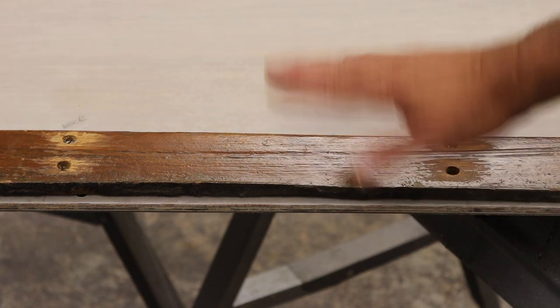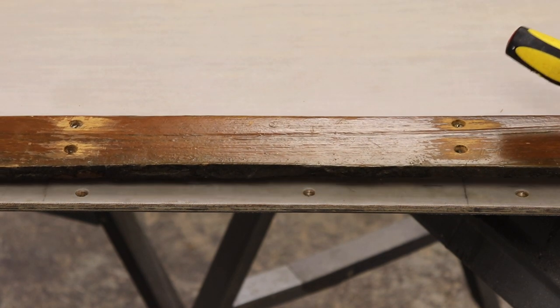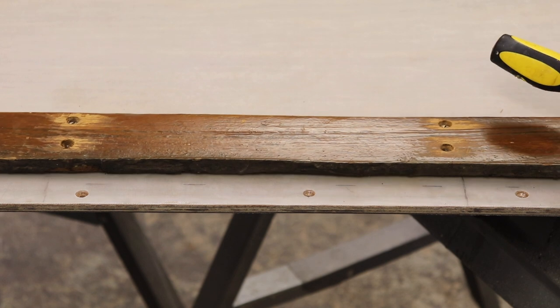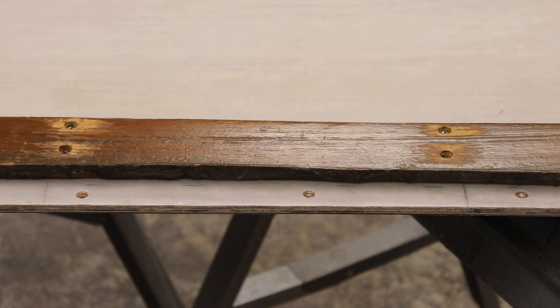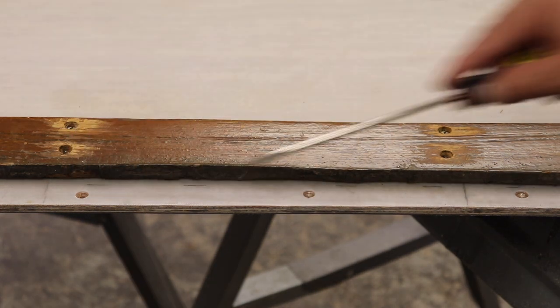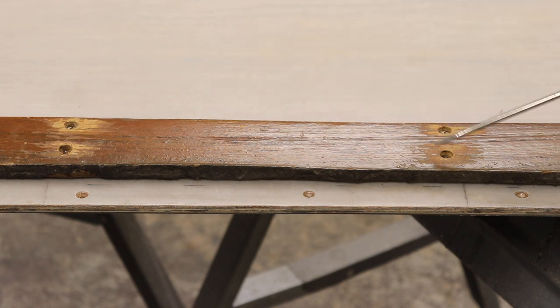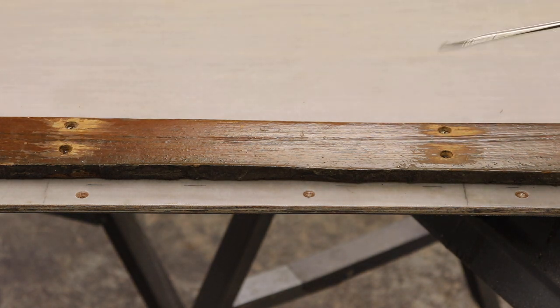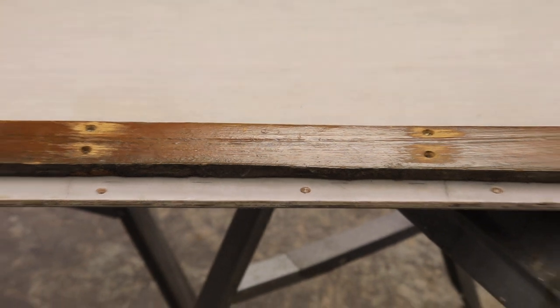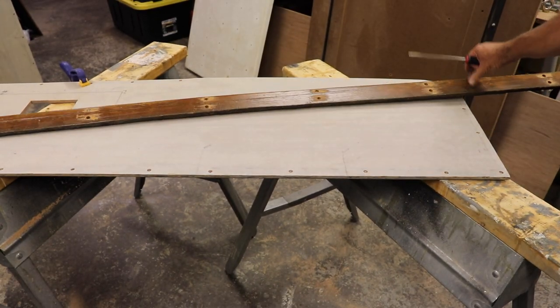I'm not going to use this piece of trim. I'm going to make a new one, but it's good for talking purposes. So I'll just move it right now because it's really going to go more up in that area. The deck's going to go below it. You see a couple lines right here kind of line up where the screws are going to go. And that's where I got to install the blocking. So I'll zoom out and get this out of the way here.